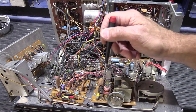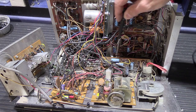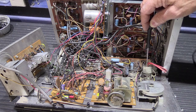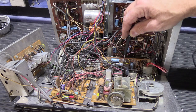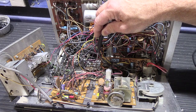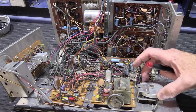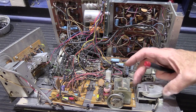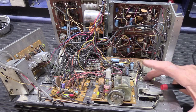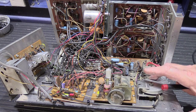This is the AM RF and IF board, all on one board. Down here is the tone and volume control board — your on-off and volume control switch, balance, treble, and bass. Your input selector switch is down here. This is the weighted flywheel I talked about for the gyroscopic tuning — a nice touch not found on any other model. It gives it a better feel than a standard dial shaft and dial string.